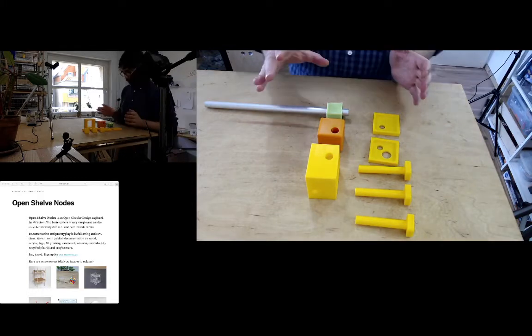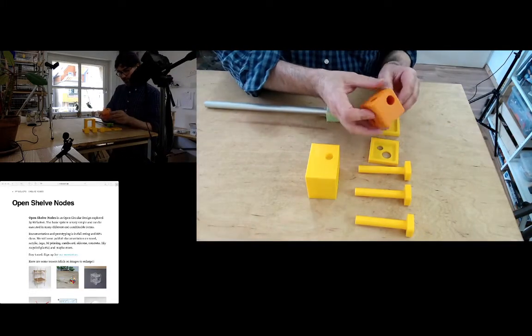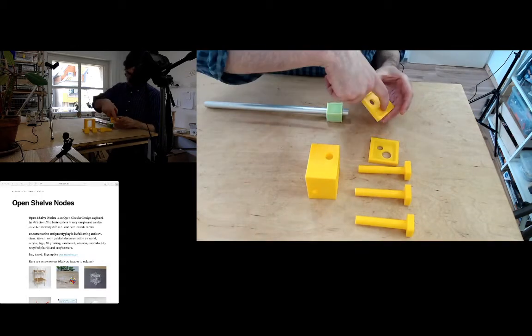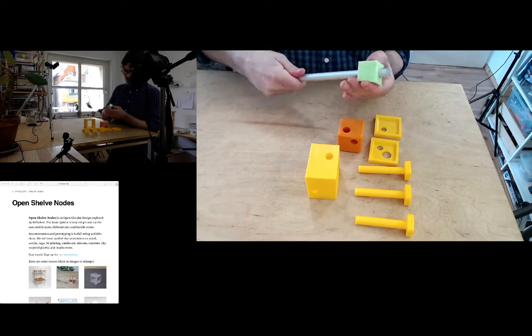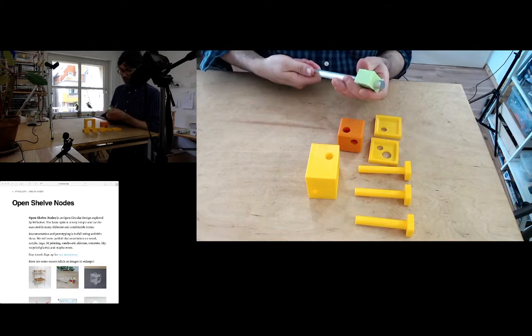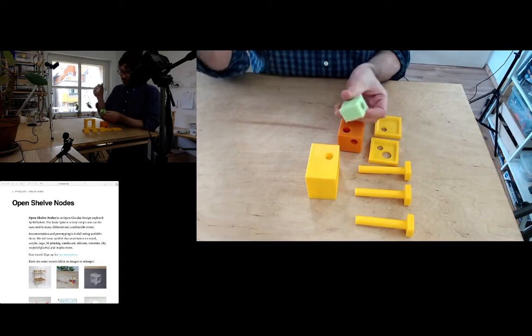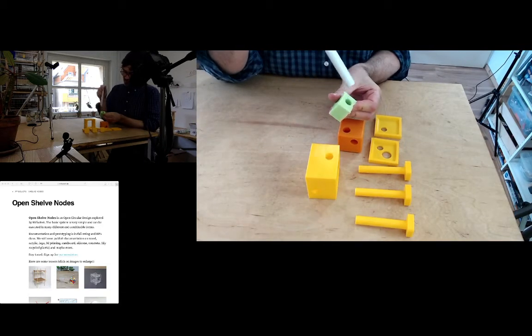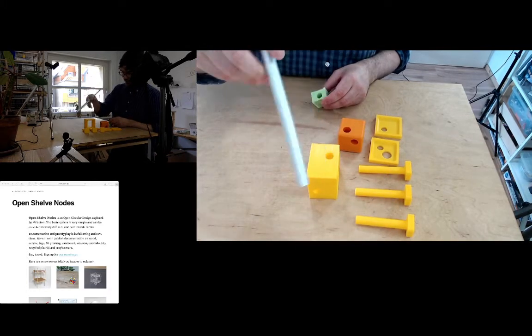Okay, this is the mold to make a silicone version, exactly this silicone version. So we have these round corners and we have them also here in the mold. And here's a test I made, and this test showed that in order to use 16 millimeter rods, you should have 16 millimeter, 14 millimeter holes in the mold. So you can see the 16 millimeter rod doesn't fit here.